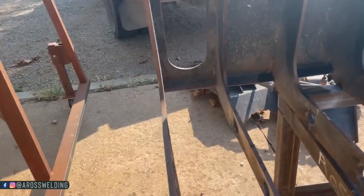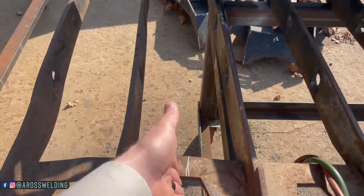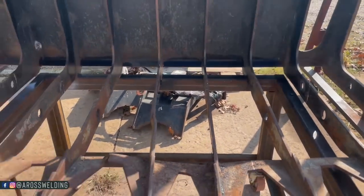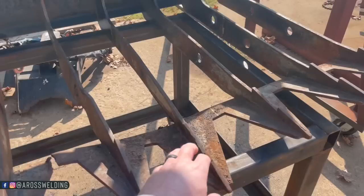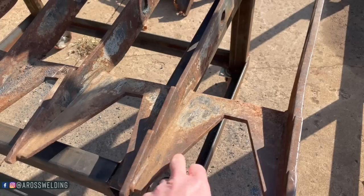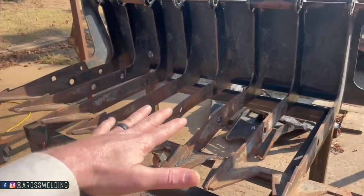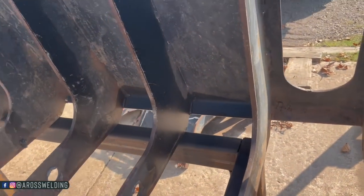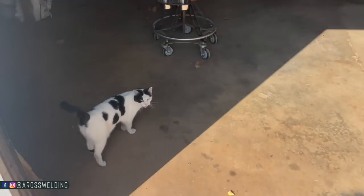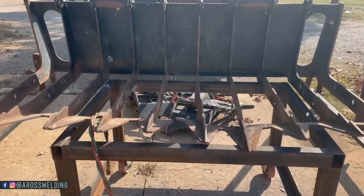I just laid them out. I'm gonna make a cut here so these two, because they're bent — these two are bad. I'm gonna cut here and cut out these two teeth, then make a cut here so those four teeth will be gone. Then I'll just have to scarf one, two, three, four, five, six pieces — scarf or use a zip disk to cut these welds so this plate will come off. We'll put that new plate on, lay our new teeth in, bevel the plates so we get full penetration weld, and clean up these holes.